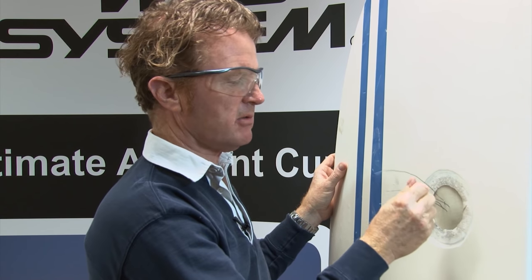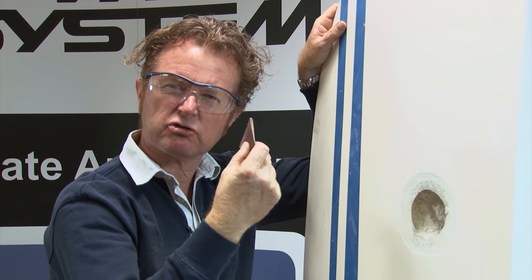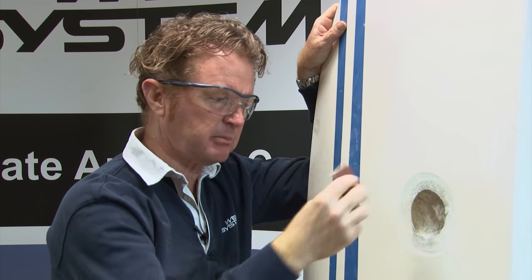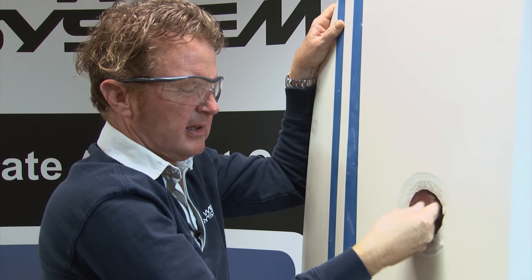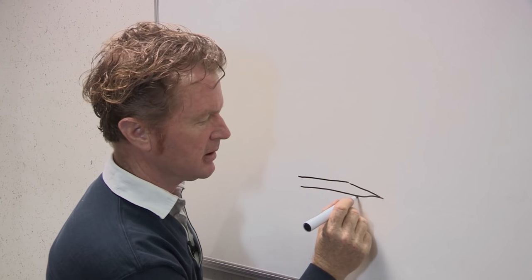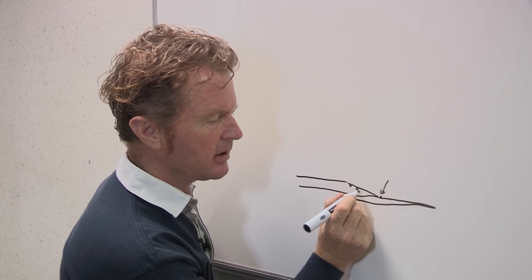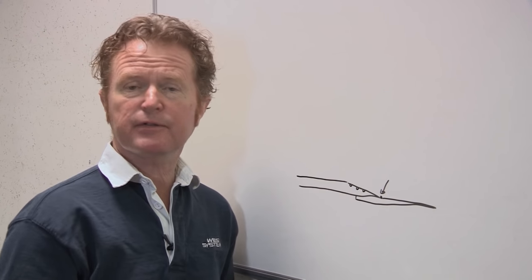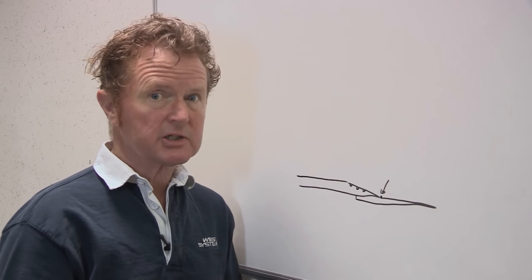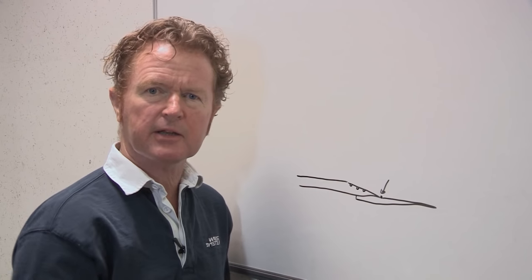I'm going to put some mixed epoxy around it and glue it back on itself. I'm now going to abrade the inside face of this to give me a really strong bond with our backing pad - just take a little bit of 60 grit paper. Back to some theory - a very important point is to make sure that you've filled the very edge of your bevel. Where the backing plate meets the bevel, you can actually have a small air bubble. You might also find air bubbles in the existing laminate. The perfect thing to fill these with is West System epoxy mixed with West System 406 colloidal silica to a mayonnaise consistency suitable for brushing.